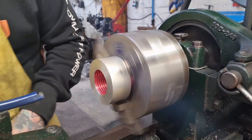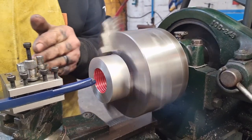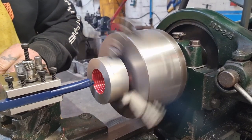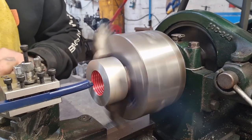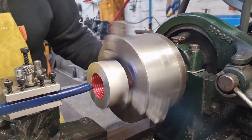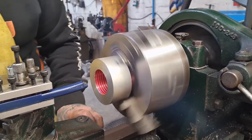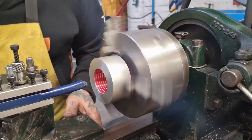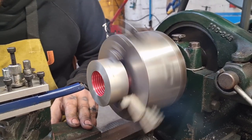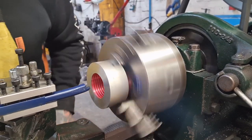We'll do another 10 thou cut. So we're backing the compound across 10 thou, which will put the mark on 80. And we're going to wait for that number 2 to come around. Good old number 2. I'm going to give myself a bit more distance in case I have to abort. I can't see the number very clearly. There it is. Right, you're going to have to wait. I'm sorry this is so tedious, but I'm scared. So, 2, in, off we go.